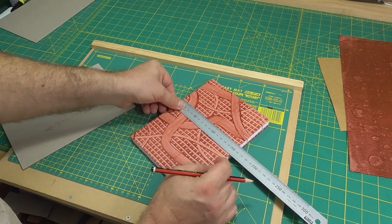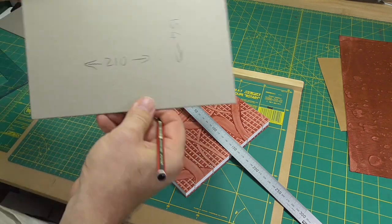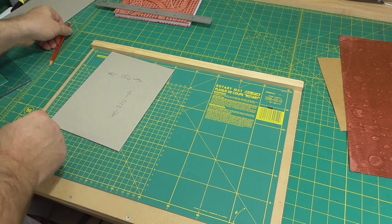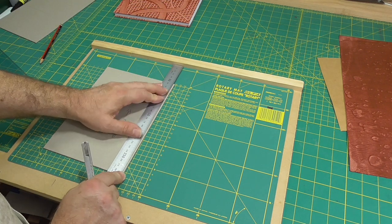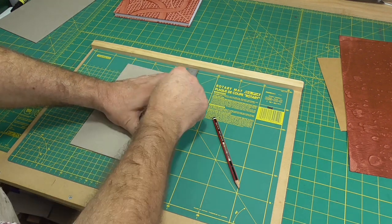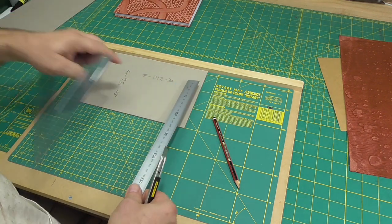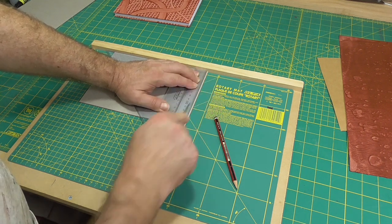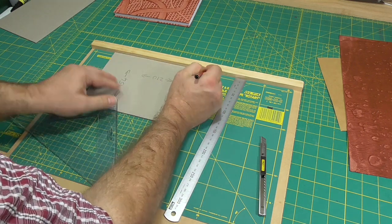The usual solution is to balance the pull, have a material on the inside and the outside that pull in equal amounts. The method that I'm going to demonstrate is to drum the materials onto the boards. That is, attach the materials at the periphery, around the edges. By not gluing out the entirety of the covering material, you almost entirely eliminate the stretch and then subsequent pull.